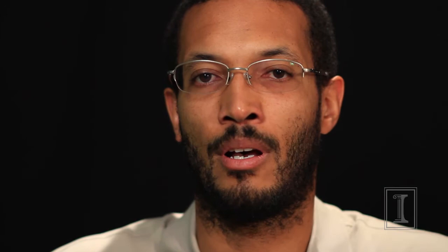Specifically, we made a video where we can see the etching of gallium arsenide in a wet etch solution. We were actually able to sculpt the three-dimensional nanoscale topography using a process known as photochemical etching. We simply display the pattern that we want to etch on the sample using a computer projector image.